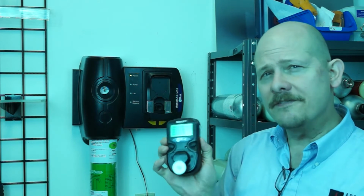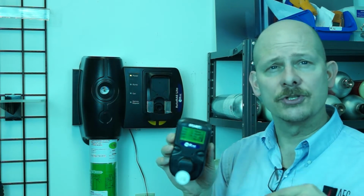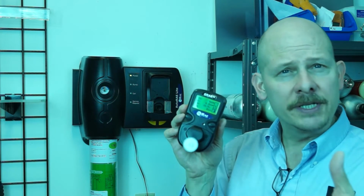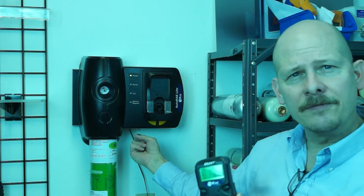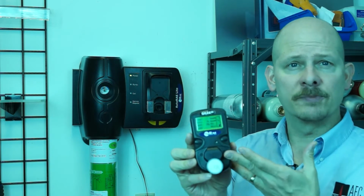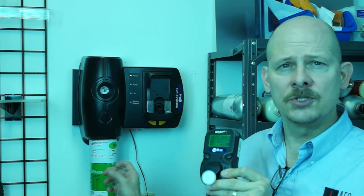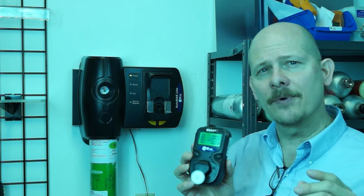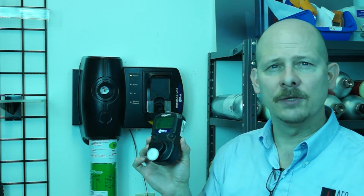So now, let's say it didn't pass the bump, it would go automatically right into calibration. So now another 2 minutes, because it's going to go ahead and zero. We use a port down at the bottom of the unit to pull in fresh air for the zero. The instrument will zero out, and then it'll go into a normal calibration cycle and set the instrument up precisely to the concentrations that are in the cylinder right here. So it does take a little bit of getting set up the first time around, but once you get it set up, you basically can run 24/7 without any worries.